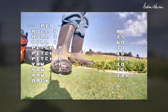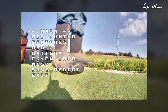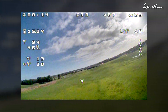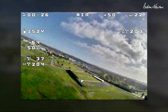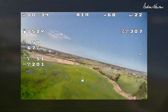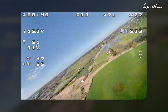I'll start with the roll PIDs and reduce them down to zero. I'll leave the roll I at 15 and roll P at zero, and we'll fly with that. There's a tiny little bit of wind around. It's just not levelling itself or anything. That's just the wind doing that, I'm not doing any inputs really. Roll P zero.